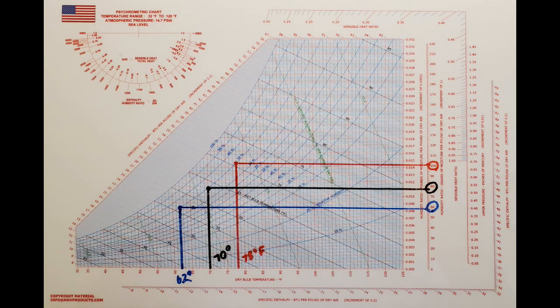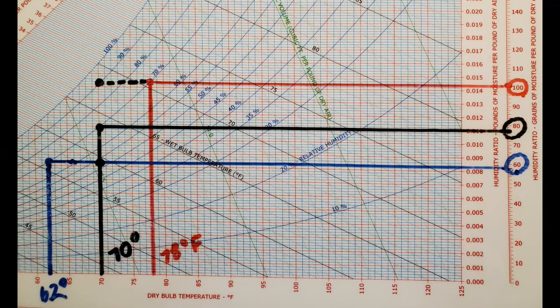What I'm showing you right now is called a psychrometric chart. It's used by engineers in climate control and relatively sophisticated applications. I've illustrated the red line, the black line, and the blue line to correspond to those glasses I just showed you, and this puts an actual number to that demonstration. At 78 degrees Fahrenheit we have about 100 grains of moisture — that's a raw way of figuring out what moisture is in the air, 100 grains of moisture per pound of dry air.